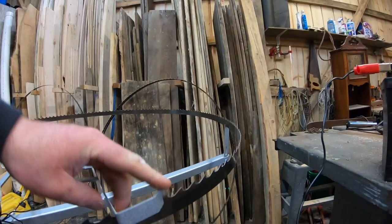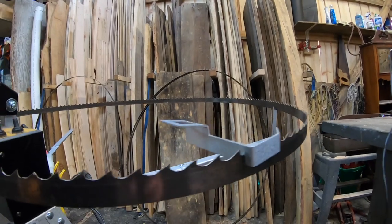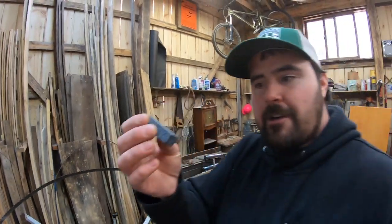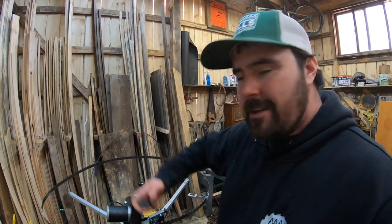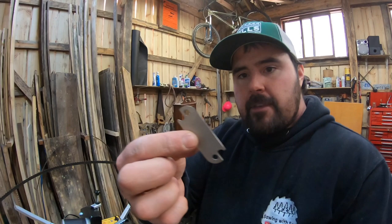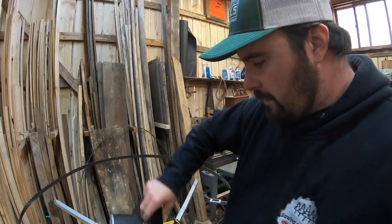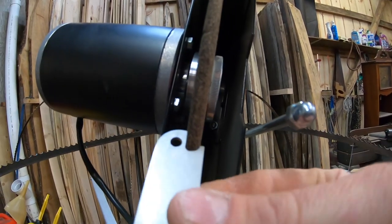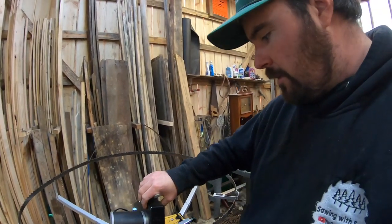This last thing I want to show you is essentially a rudimentary piece of metal that stops the sharpener once it gets back to the position where you started — that turned out to be a very useful feature. The other useful bit I found in the first month is this: after I go through and sharpen one or two blades I check the profile of the sharpening stone using this profile tool. You flip it up, take the bit like this, and see how closely it matches up. I find after a blade or so I always do that to guarantee I'm getting the right sharpen.